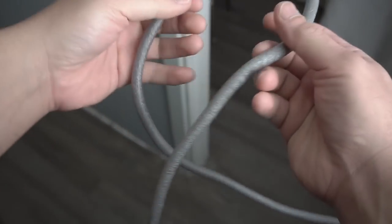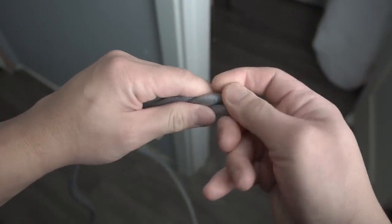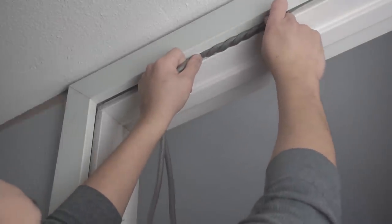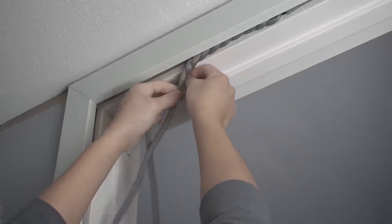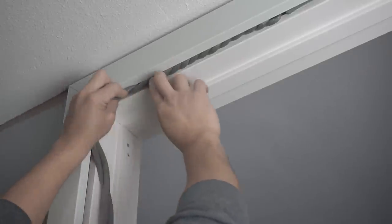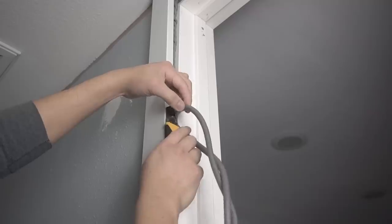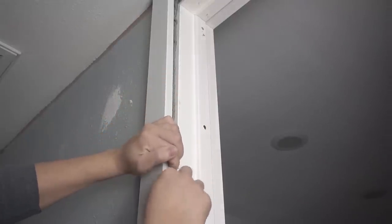Once you get to the larger gaps, cut off the backer rod. According to the directions, you actually put two together and start twisting them like a pretzel. Maintain one side clamped so it stays twisted, then twist it to your desired length and carefully push it in. You don't need any special tool — just use your fingers to tuck it in. If it starts sinking more, shove in more backer rod to fill the gap. Be careful on the turns — I'm using these on the 90-degree bend. When it tapers back to a quarter inch, cut it and continue down the line.